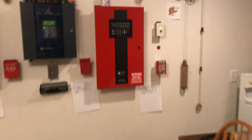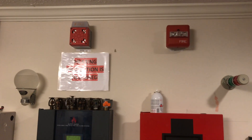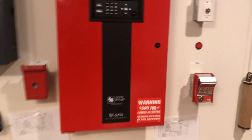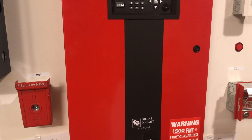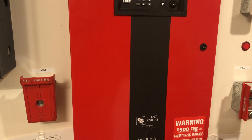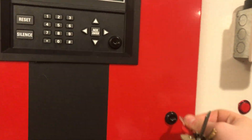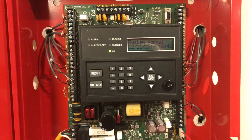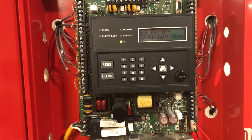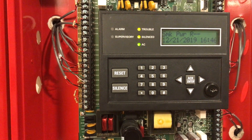To begin the test we'll start with the FCI MS2. Lift and pull — okay, that's unusual. I wonder why that auto-reset. It didn't do that before. Something is not correct. It's not even going long enough to be stuck in walk test — that's really weird.